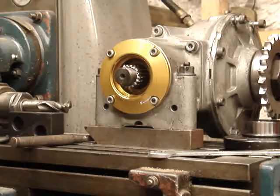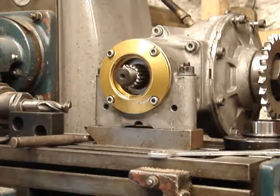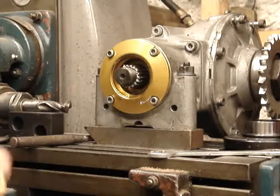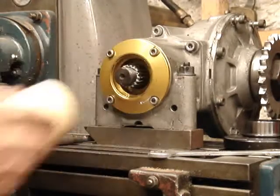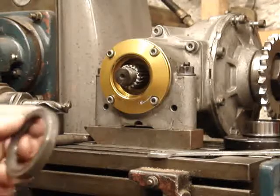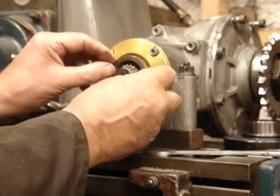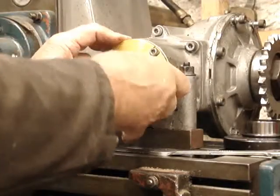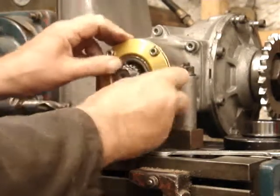For the new seal — I've oiled it so I'll wipe a bit off so you can see it — some of the new SKF seals have all these little ridges around the outside. I've always been in the habit of fitting the old plain rubber outer type by turning up a wooden block with a flat face and a central hole to centralise it, then tapping them in with a mallet. Sadly that doesn't work on these ridged ones — tapping won't get them in; they just bounce out again. The best thing is to wipe a little oil around the outside of the seal to make it slide more easily, then with care, perseverance, and strong thumbs you can push it in.